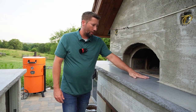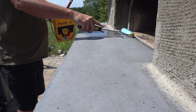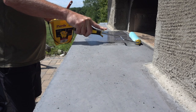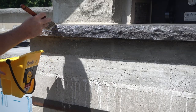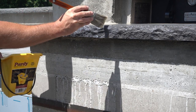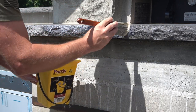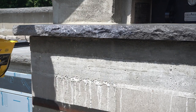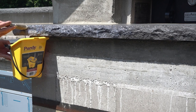I used a standard trim roller for the top surface and a standard brush for the rock face. I get the sealer on the brush and just tap it into the face of the rock, which gives the sealer a chance to get into all the crevices and make sure you get a good seal on that rock face.